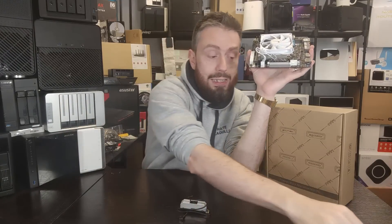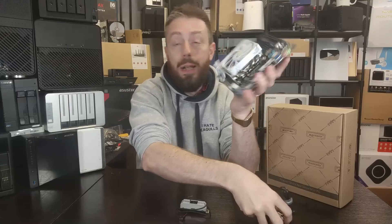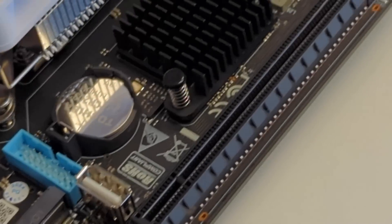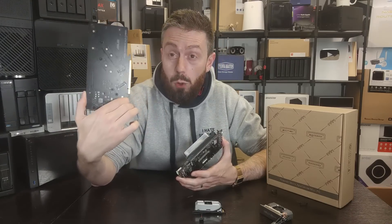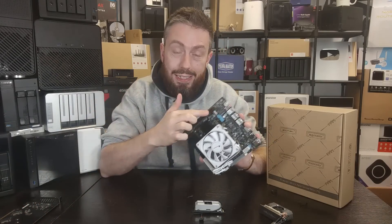Keep in mind that the M.2 slot for Gen 5, as you can see there on top, is going to need serious heatsinks to take advantage of that. The Gen 5 heatsinks are getting super beefy, so do factor in just how much space you're going to be playing with. Now talking of space, let's talk about the PCIe Gen 5 x16 slot - a full x16 - which means not only can you take advantage of high performance network cards, but also Gen 5 upgrade cards that will allow you to add further Gen 4 slots via that Gen 5 open PCIe bandwidth. You will need a dedicated controller on board, but you can really spread its wings on that single PCIe slot.